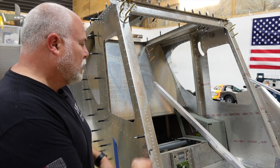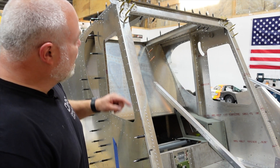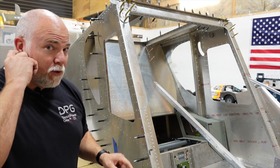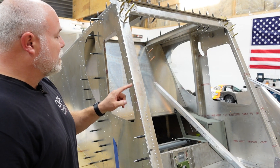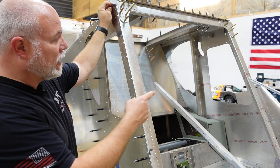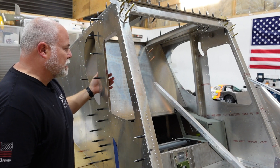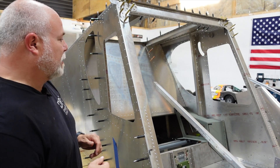I had already put in 18 A5 rivets down the side on both sides. Luckily I didn't do the whole thing, so now I have to drill out eighteen rivets on both sides, take out the clecos at the top, and pull these side channels out. Luckily the rear channels are still clecoed in — I was about to rivet those because that's how you get the mixing arm installed in the back; you have to rivet those front and back.